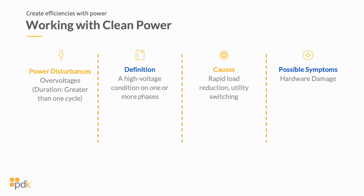Over voltages. Like I said before, this is a slight over voltage. So a product that utilizes 12 volts DC and you're powering it at 13 and a half or 14 volts, most of the time the hardware is saying that it can run up to 16 volts. It may say this hardware can run between 12 and 16 volts. So if you're using a 14 volt output power supply that's typically rated at 12 volts, that's not an issue at all, because you're within that voltage range. But if you start getting above 16 volts and running that thing at 18 or 19 or 20 volts, you could really start to cause some issues. You're typically going to burn something up at that point because it just doesn't have the capability of being overvolted.